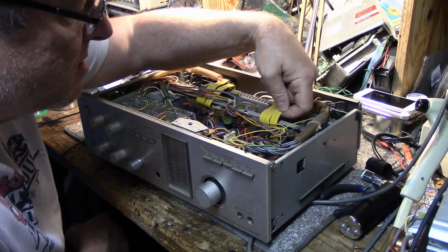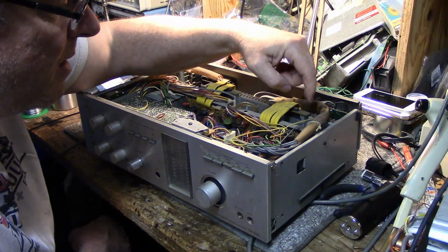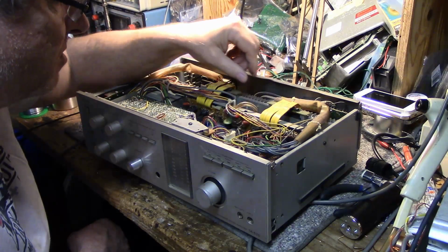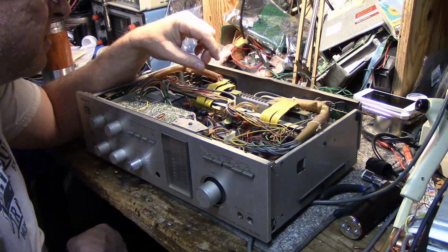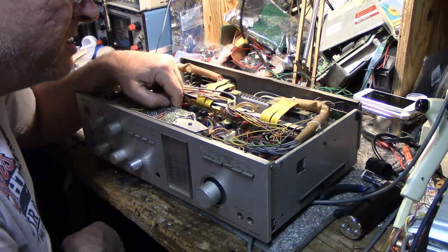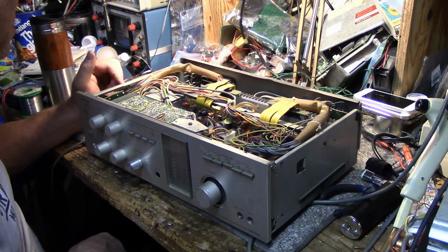It's these ribbon cables to connect from the power amplifier to the little subboard here for the power chip, and they got that extra 3-4 inches of leads there, which adds to crosstalk and impedance and all those nasty things that work against amplifiers. But anyways, I'll have to check all the connections on all these solder joints, and it's just going to be a general service.